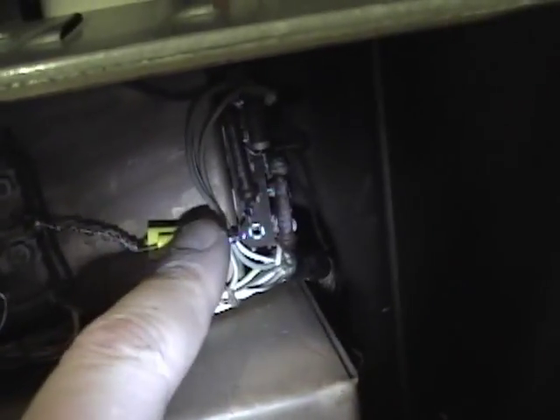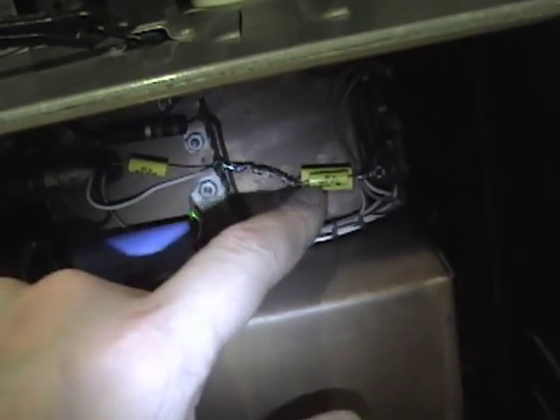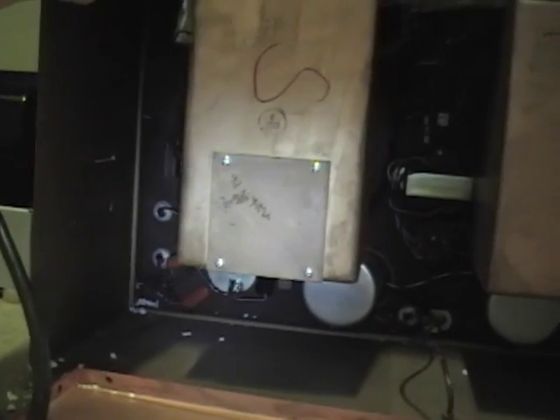Clearly it's been worked on. There are some new orange drop capacitors in here, and it looks like they doubled some up to get the right value — same with the power resistors. If I were going to use this in regular service I'd go over all of these again and probably find single caps with the right values instead of these paralleled ones. Even the potentiometers are encased in shields — this is quite well made. I've noticed in a lot of vintage test equipment they put a lot of effort into shielding and layout, which is why I like this stuff. It's big and heavy but really well engineered — very clever designs.